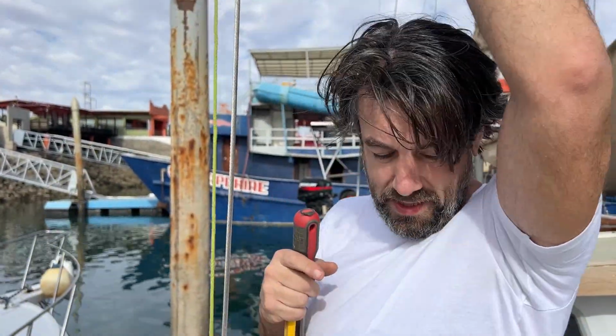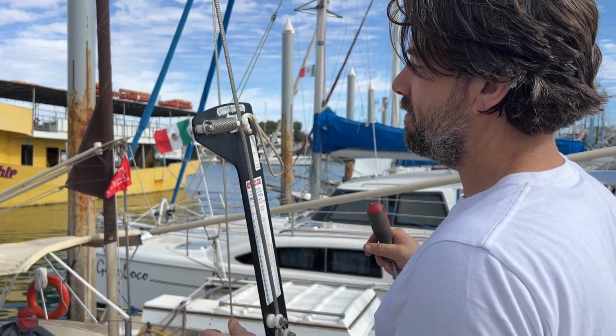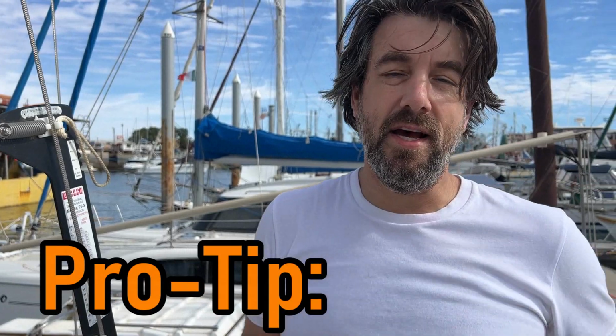That was quite a process, man. I had to straighten the mast because it felt like it was going a little to the port side, and the rigging is solid now, baby. That'll save you some time if you ever have to do this, is realize that tightening this side also tightens that side a little bit. So I took this side to 15, tightened that one to 17, and now they're both measuring at 17. Nice. Yeah, that took some learning.